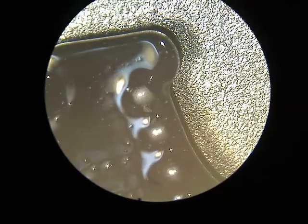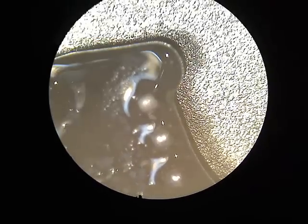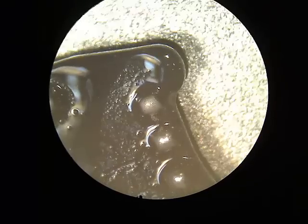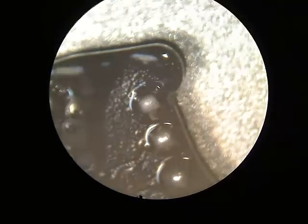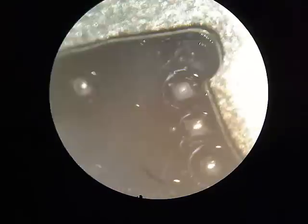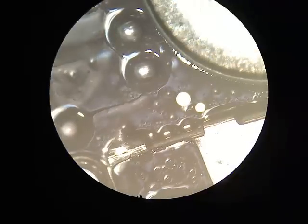The solution to pollution is dilution. Drown it in isopropyl alcohol. And since this is lead-free solder — remember it's lead-free — you dilute it with a lot of isopropyl alcohol and all those little solder balls will get washed away and will not remain on the logic board. You really just don't want any solder balls on the logic board, so be careful around the components and keep those solder balls away from them.